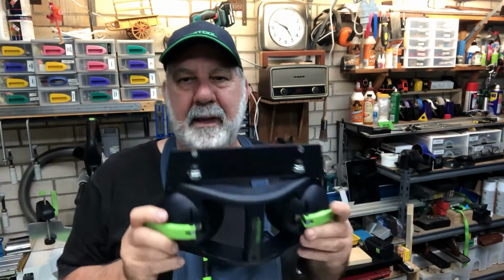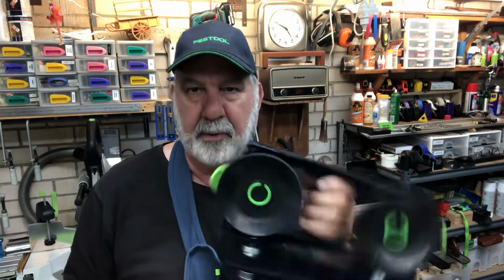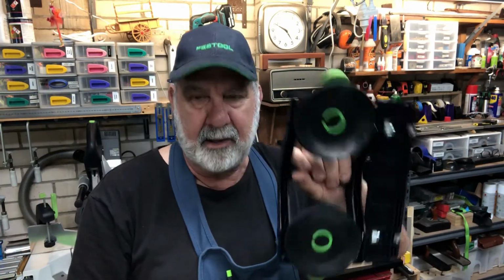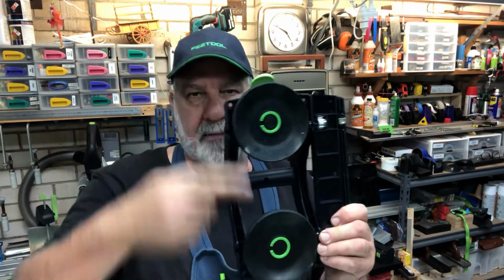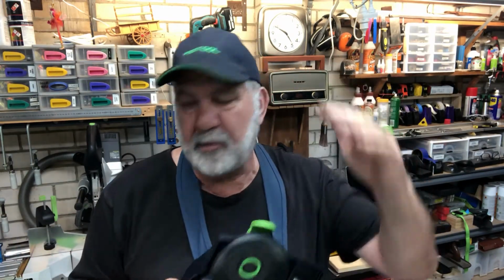the gecko, it's big, it's about 300 millimeters long, and when you put it on the rail, on a big job, no problem at all, it's fabulous, it locks down because you've got two of them and it really locks down. But I found that when I'm using the GRS saw guide, when I wanted to lock this down, obviously I can only cut a board approximately 350 wide and still be able to lock it down.